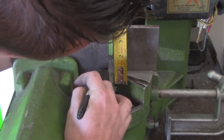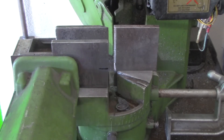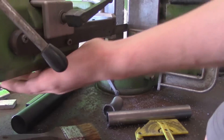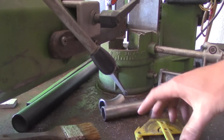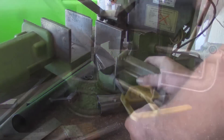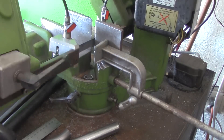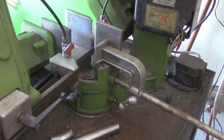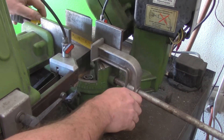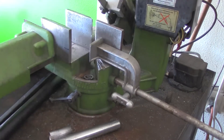Now I'm going to mark my saw at the same inch and a half, and this is our clocking reference. So as soon as we get set up here, I'm going to run nine degree pie cuts and we're still going to have an 18 degree transition angle. So the nine degree cut angle, 18 degree transition — set up the angle finder, just get the saw clocked where it needs to be at nine degrees. And here is my distance, which I usually measure at the widest part of the pie cut, which is usually at the top. And in this case, it's set for an inch for our center line areas, which we calculated.